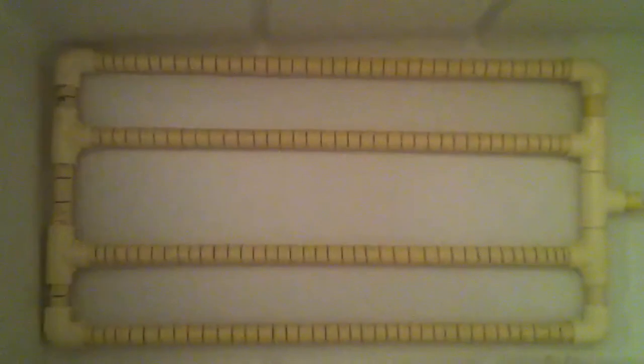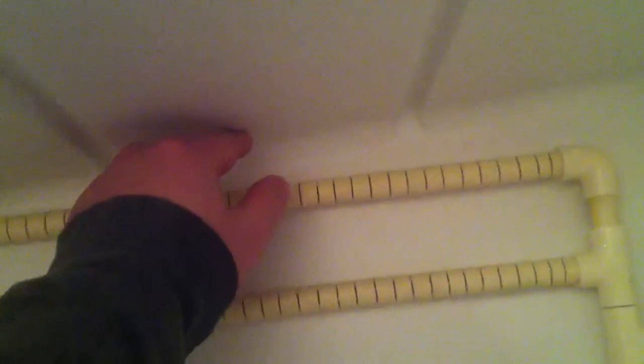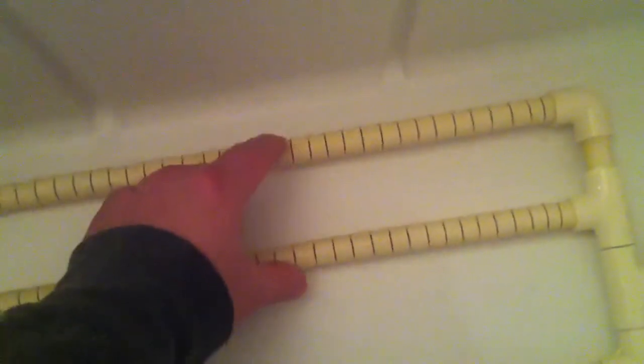For my manifold, I'll show you the underside. This is half-inch CPVC — I bought a five-foot long piece, cut it up with a pipe cutter, and put slits in it with a hacksaw. I tried to stick to John Palmer's specs for building a manifold. The pipes are supposed to be equidistant from each other, which isn't exact due to the space limitations from the T-pieces and the cooler walls, but it's pretty close.